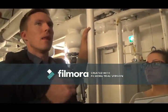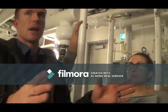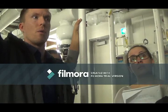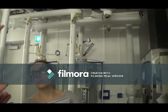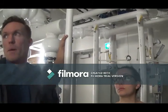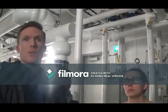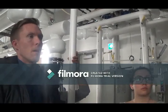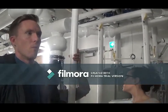The fact that they had one would be in disorder, that would be the lead boiler, that would be the lag. Or I thought typically that's the layout, since you've numbered it 1, 2, 3, but they have labeled this one as master on the right, so I'm assuming that's their master. But in terms of how these boilers work, that's completely dependent on the module, the BAS system. Okay. So if they choose that to be the master, then that's your master. But typically they'll be evening out run times.